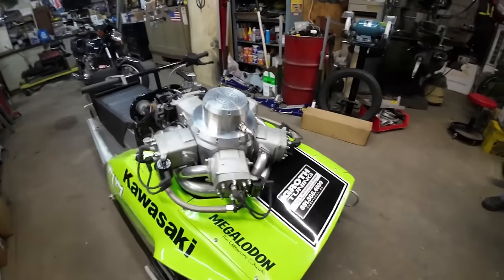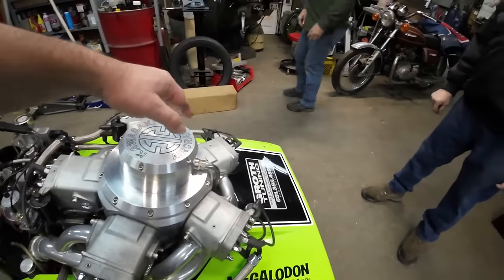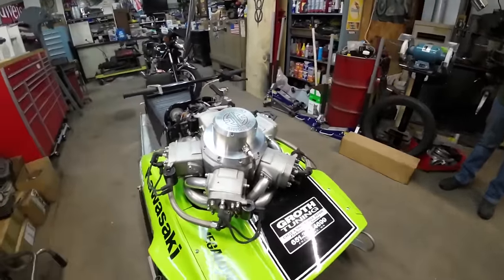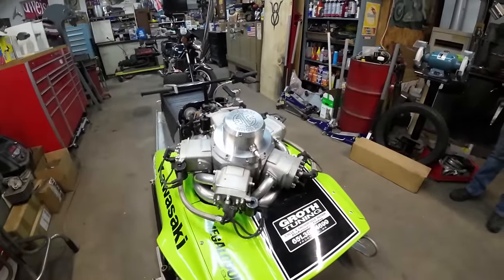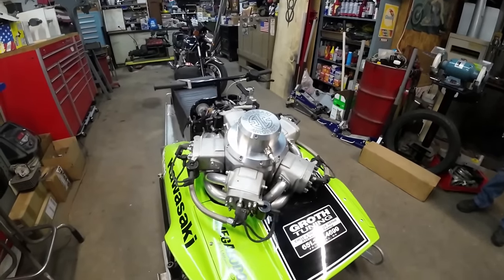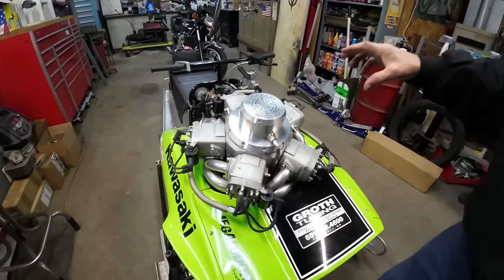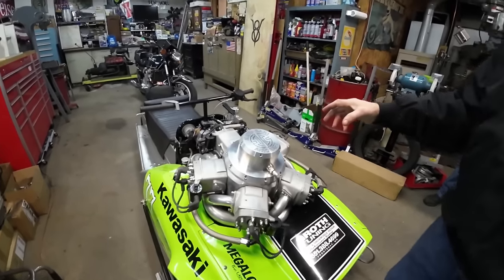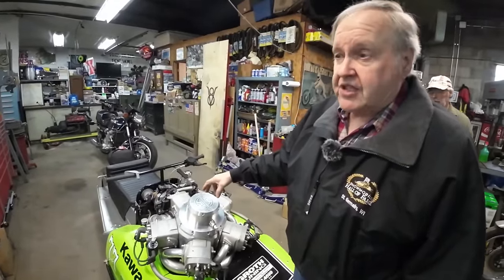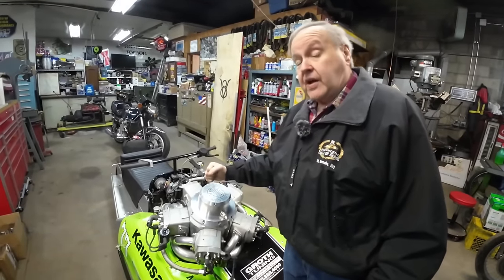being a two-stroke but with five pistons radially displaced, I'm assuming, am I correct when I think there's one crank throw? Yes. How do you have them on one crank throw? Because you have one master rod, and four link rods that connect to that master rod. They're all perfectly in line, and there's one crank throw. It has the stock stroke from a 440, I think right around 60 millimeters. It's quite a heavy duty unit.